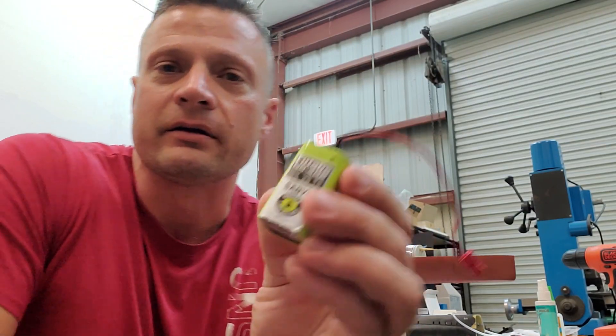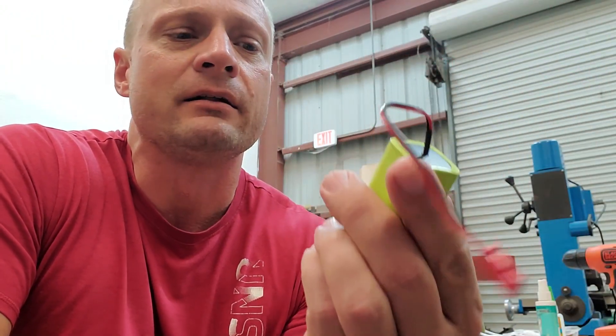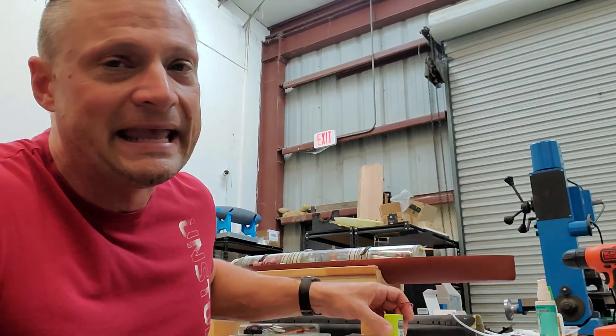The solution was simply to add a peripheral battery pack — this is a nickel-cadmium NiCad battery pack with a little tail on the end. In most cases there will be a dedicated battery port on your receiver, or on more modern ones they share a common power bus across all of the servo ports, which means you can plug it into any of those ports to supply power to your receiver.